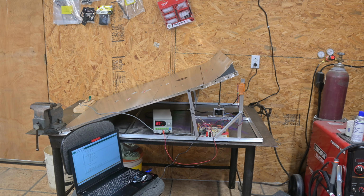Originally I had planned on just using an accelerometer on this thing to pick up the hit on the ramp, and then have twin 5th scale servos spin the deck, but I thought there'd be an issue with timing. I wouldn't be able to quite get that deck to move quick enough, and the other issue is the servos are $250 a piece, where my little homemade linear actuator back there was like $20 when I was able to make that. I'll go into that stuff more later on.